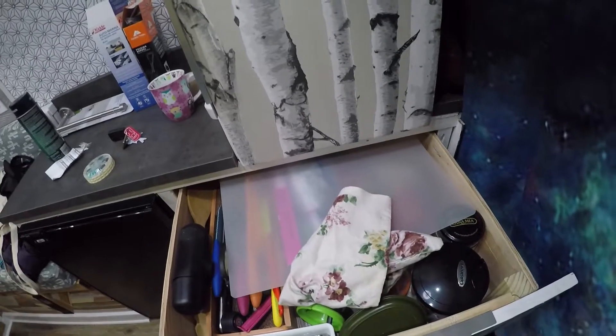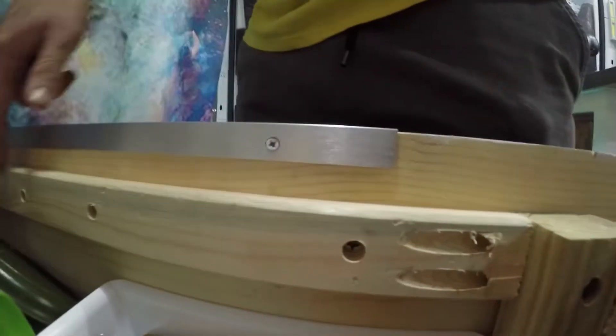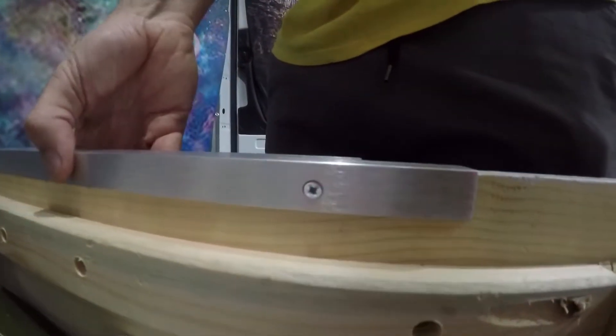Here's another drawer. This one locks down like this — it's not the best solution but whatever. And then you pull this bad boy open. This is basically our kitchen everything drawer. This was built the same way as the one I showed — just plywood sides. I went with bigger one-by-ones to tie it all together, and I even have this along the front because after a few weeks it really started to come off. I also blew it out and then put liquid nail on there.